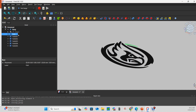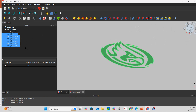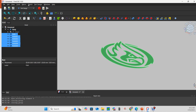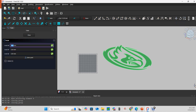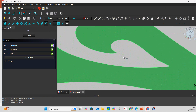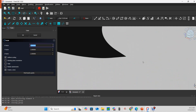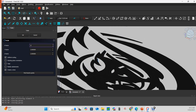Now I want to pick all of these paths, so I'll control-shift and choose all of them, then go into the draft workbench. Way over here in this set of tools there's the scale tool. I'll scale it right away — picking a point somewhere in the center so it scales out from that point. We'll make that a 2x scale in X, Y, and Z.